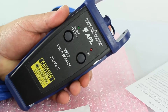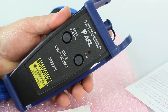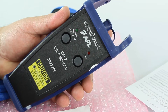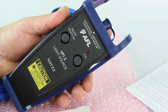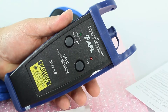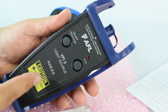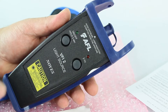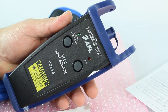This visual fault finder is basically a visible red laser designed to inject light energy into your fiber. Sharp bends, breaks, faulty connectors, and other faults will leak the red light generated by the VFI, allowing technicians to visually spot defects. That's the most common use of this tool. For new guys just getting started terminating AFL fast connectors in the field, there are a couple of windows on the bottom of the connector that will help you get started on the right path.